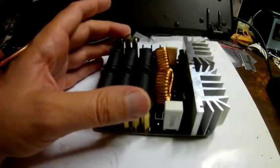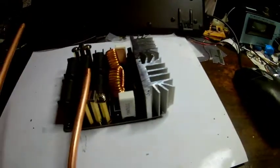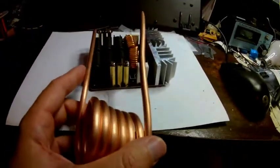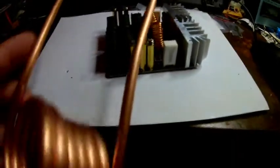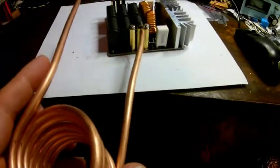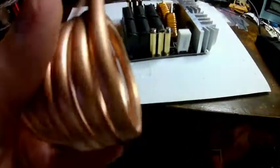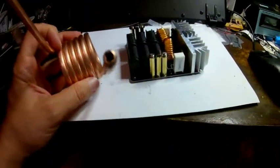I'm not sure exactly how I'm going to fit this coil. Looks like these are the output terminals here, and they're not really oriented in a very nice way to put the coil in. Maybe I can fit it in there without bending too much, but you've got to be careful when you bend these copper coils — you usually have to put sand or something inside them, or use a special bender, or they'll crimp and cause problems.